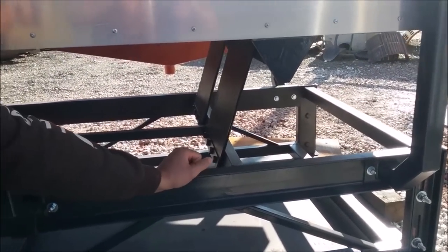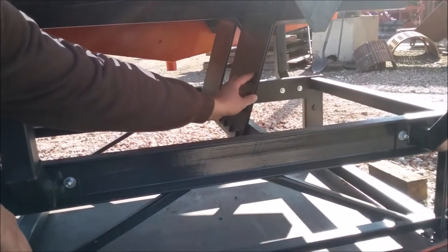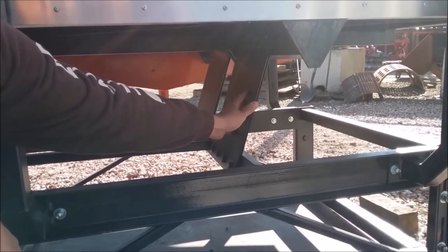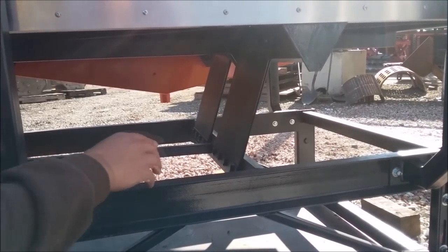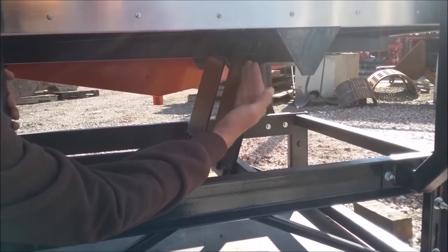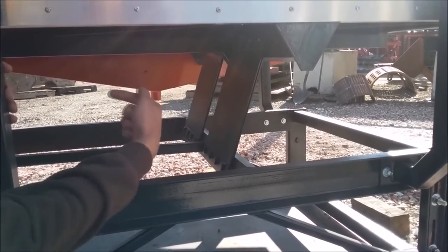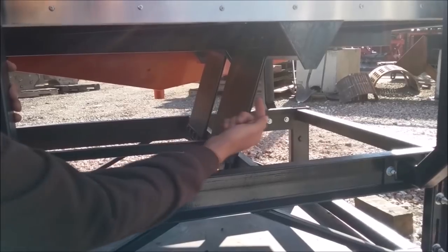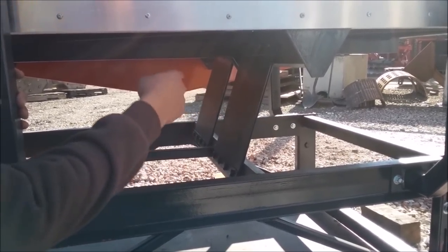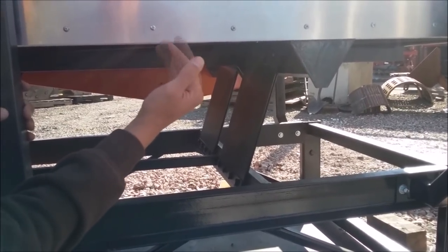I wanted to talk a little bit about the mechanics of the shaker table now. Our shaker table top is supported by four different sets of springs — these are just steel sheet springs that hold the shaker table top to the base. They're angled at about 15 degrees. And when the shaker table moves, it forces the material to not only move across the table towards the high grade end, but also gives it a little throw up, so the force allows the material to hop down the grooves. If they're straight up and down, nothing goes anywhere — it just goes back and forth.